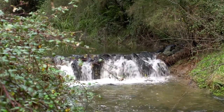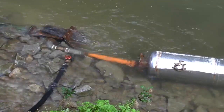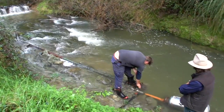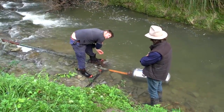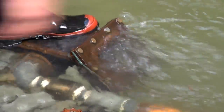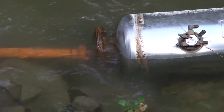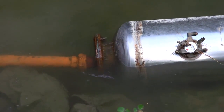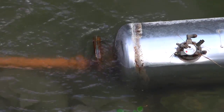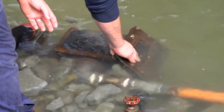The whole mechanics of a ram pump was first discovered back in the 17th century — the first processes of how it would work. It's really very simple: it's the gravity fall of water with two valves — one that gets shut as the friction of water starts to fall down the delivery pipe, and then pressured back into a chamber against air pressure. In this case, it was just a kind of inner tube inside a chamber pumped to 70-pound pressure.